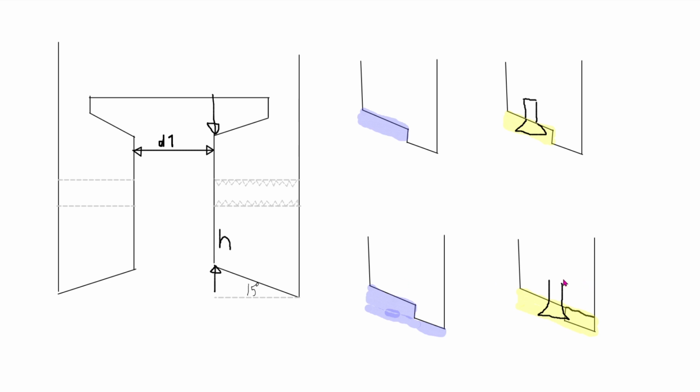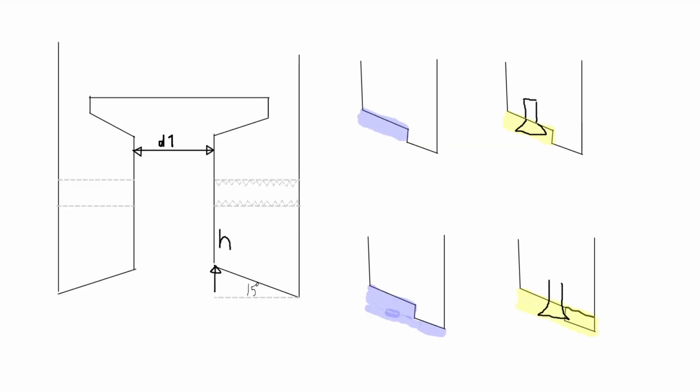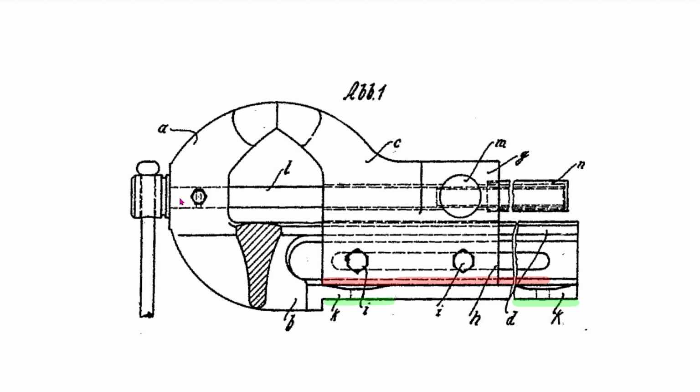Okay, so once you have built it up, now you need to machine or file this down, and you would think, okay, I use the top slide area as reference, but that doesn't really work that well. If we look at the side of the dynamic jaw, these are the contact areas, this is the bolt hole, they should be parallel to each other, and we could use the top. But in reality, on a worn down one, this is the worn down contact area we just built up, right? And if you look at the top, you will see that this is also mangled. Why is that? At the back, I don't know, but the front is kind of understandable, because in a back opening vise, you always have the force from the lead screw going to the nut, and from the nut it goes upwards to the jaw and clamps the workpiece.